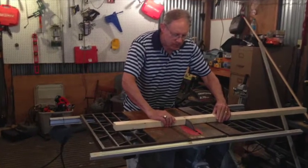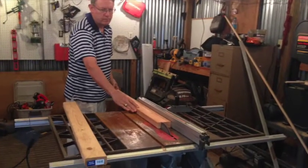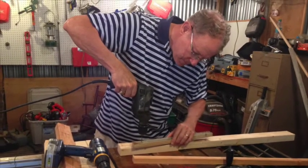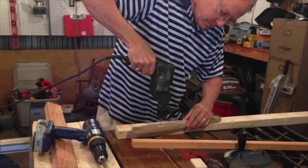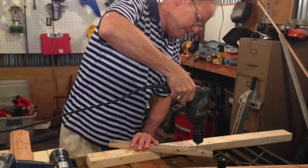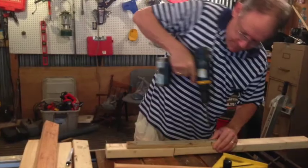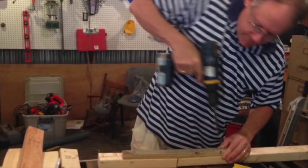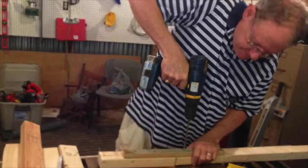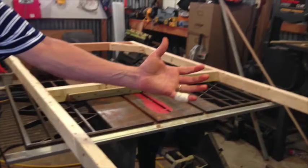I ended up having enough time to do some sub-assembly work — I put together the side panels and the end panels and cut some of the boards. I miss-figured material as I often do, but I had two-by-fours laying around and was able to rip one to make what I needed. I also wanted to use up all the material and be as efficient as I could. I took some drop-off pieces that weren't quite long enough and scabbed them together so they'd be long enough — used up all the material, didn't waste anything, and it's on the inside so it wouldn't be seen.